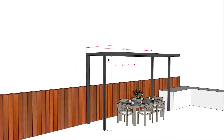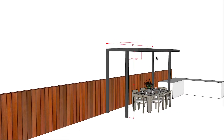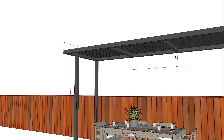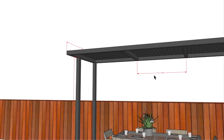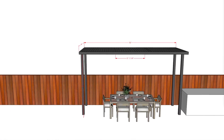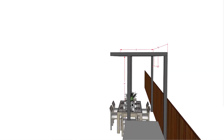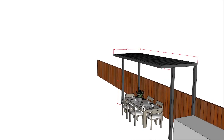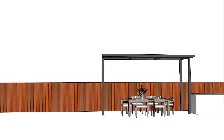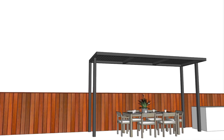Just to note that I have this structure so that it's level. If it's at an angle, something may have to change slightly, and I'll try to address that in a minute. The placement of these will not be too critical, but if they're closer than this five-foot dimension, that will also have to be addressed. You can see we're just looking at a dining space over here, and the dining space is offset from the structure itself, so placing the heater is important to make sure we heat the entire space. The structure is all aluminum.